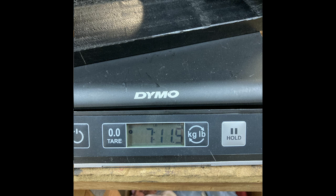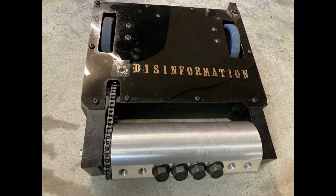This was where I tried to assemble it to see how everything would go together. Unfortunately, throwing everything together and putting it on the scale, I was still about a half a pound heavy. So the decision was made to thin the bottom of the robot. The bottom was a half inch thick like the sides were, and although I wanted that extra strength, I eventually decided to thin it down to three-eighths of an inch. And that brought us to our final weight.